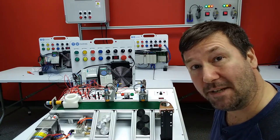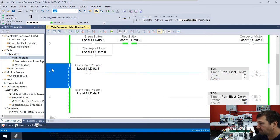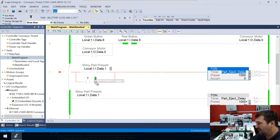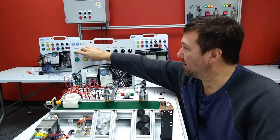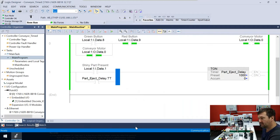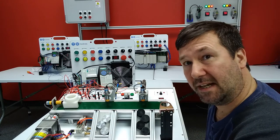We could do that with the timer timing bit. So now what we're going to do is edit our program — you can do this offline or online, whichever you prefer. I'm going to add a branch here, then add an examine if on and look at this Part Eject Delay dot TT. Let's download that and see what it does. Now we'll hit our green button to get our conveyor going again and put our part here — and we see it going all the way up to 1000 instead of just that little blip of time over the sensor.